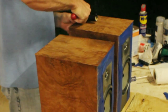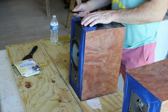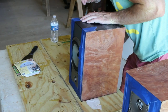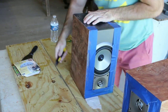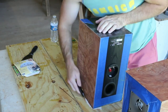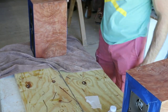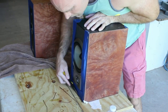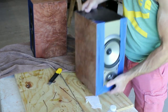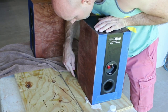After that I called it a night, and here we are the next morning. Let it dry a little bit because the veneer can move as it dries, so it's been all night. Moisture and humidity in your house is different than outside, and this veneer can move a little bit — just something to be aware of. Now again I'm not trying to make these cuts perfect — just removing some of the excess material — then we're going to use our sanding block to get it perfect.